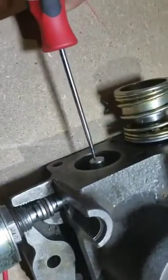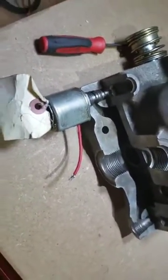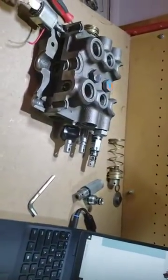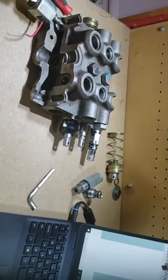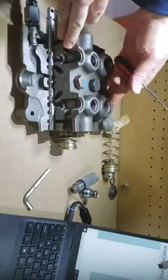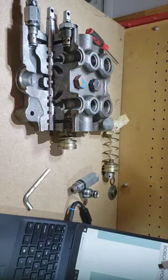By proportioning oil in there, it shifts that spool, so the auxiliary spool shifts back and forth with electro-hydraulic pilot pressure. A couple other things we want to finish off with on this valve — I want to talk about the one-way flow restrictor.